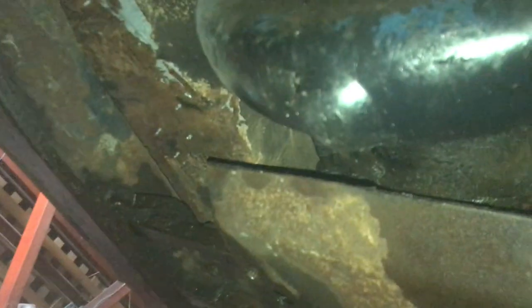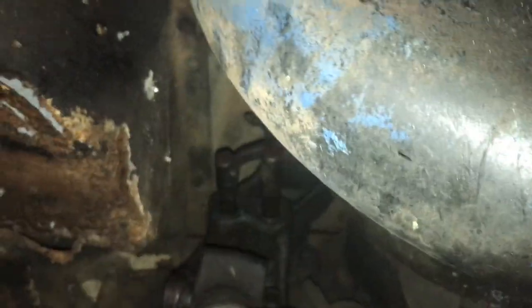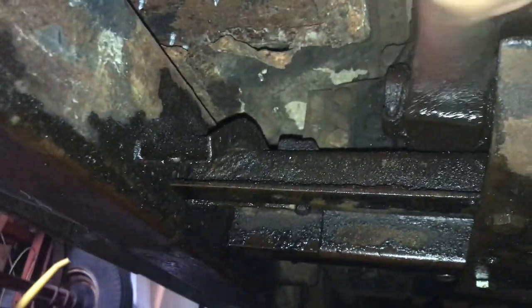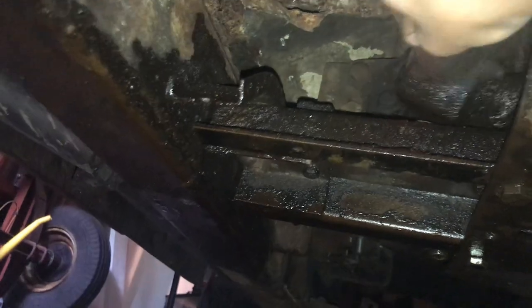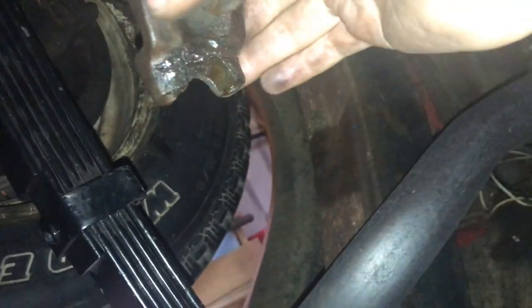Now I'm going to move to the vehicle and install it. I put a little grease on the splines — that gives lubrication because the driveshaft does slide in and out of the housing as your suspension flexes. There usually is a grease fitting on there but it's rather hard to access. This other U-joint is still good; it doesn't vibrate at all and looks like it's been replaced. I'm going to slide the driveshaft in, clean up the yoke, slide in the U-bolts, and show you guys how to do that too.